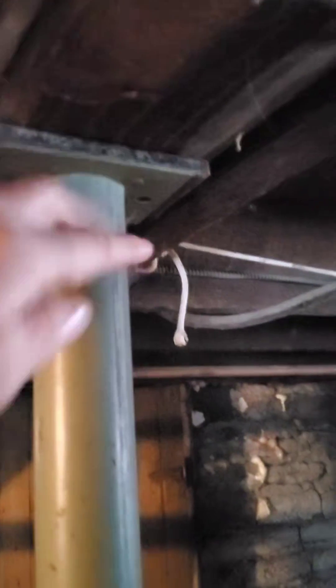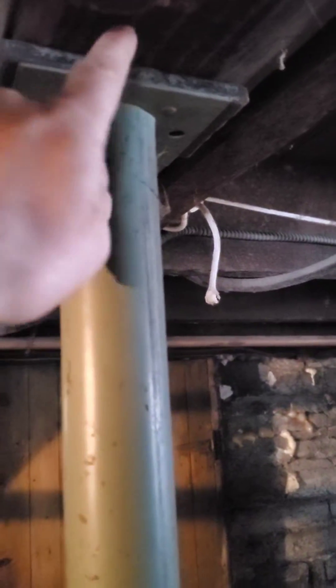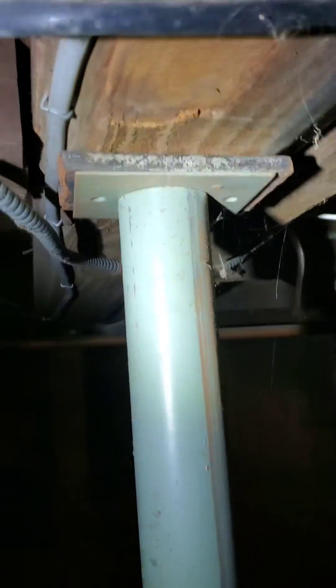And up here, this little plate right here — that plate is what the problem is on that pin. When they put it upright, it usually bends and that pin pushes up into the wood. But you can see the pole is much wider diameter here, so it gives you a broader footing. In this particular implementation, they actually put a big steel plate under it, so it's not actually bowing at all. So if you're going to do it wrong, this is the rightest way to do it wrong: big steel plate, post upside down, and then you just keep an eye on that rust.